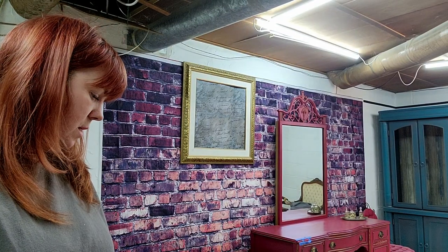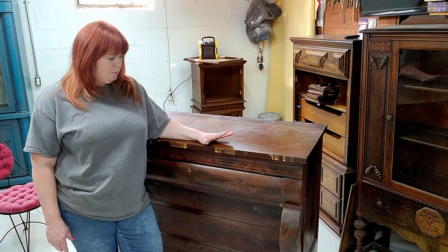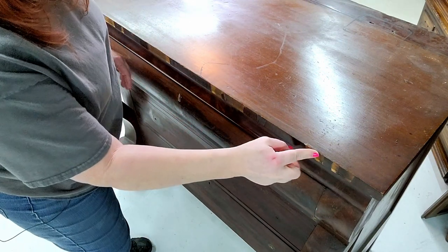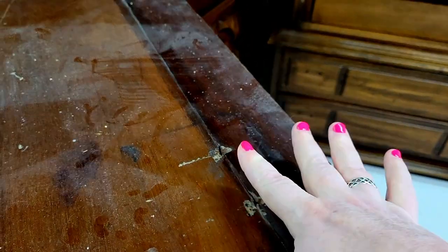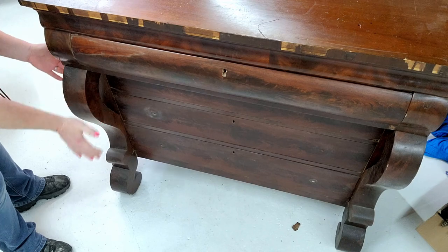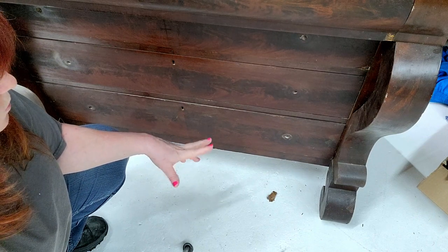Don't worry, I'm not doing anything to the original parts of this beautiful Empire chest — the Empire dresser. You've asked about it and we're going to see what we can do with it. I believe under all of this old varnish it has a flame veneer on it, but it also has a lot of problems. We've got a lot of missing veneer on the front, pretty serious cracks, holes where there was obviously a post and probably a mirror. These pieces are detached and move — this one is just really bad. We've got drawers that are chipped, veneer missing. It's got good bones but it's got issues.